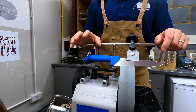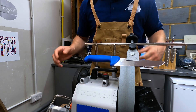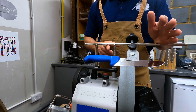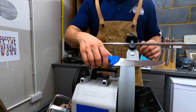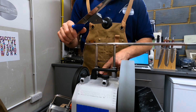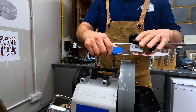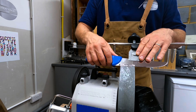Having taken those measurements and inputted them into the software, the answer comes out as 166.97mm. That's the height from the top of the bar down to the frame of the Tormek. I've set the USB height to that point and now I've got a knife ready to sharpen — switch on the Tormek and away we go.